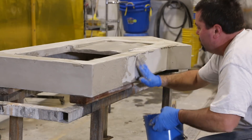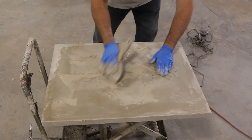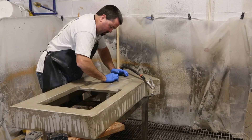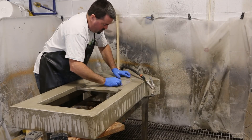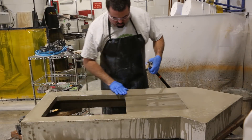Because there is a polymer and a pigment in this mix, the porous concrete may be colored differently. Therefore, we applied the bone paste to the entire surface. Once dry, usually overnight, I polished the slurry residue off with a 200 grit polishing pad. I cleaned the top and allowed to dry.